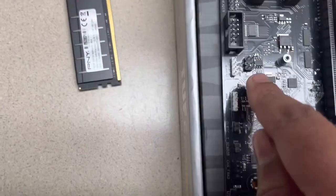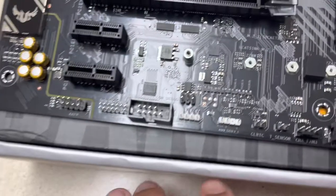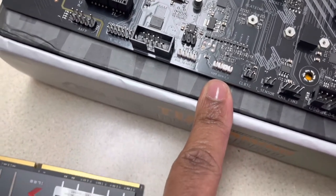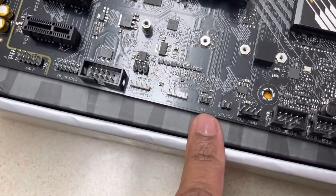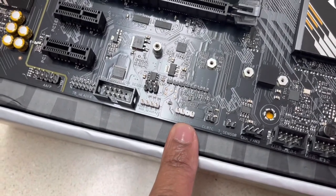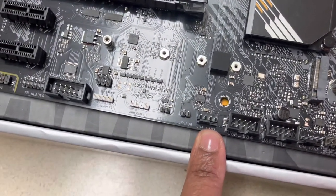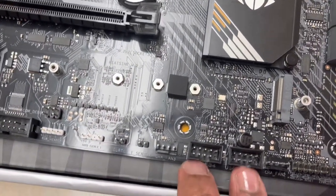This is for your addressable RGB headers — if you want to put LED strips in your case, that's what you use here. This is your addressable 3-pin header for your fans — case fans or anything else. I'm going to hook my front case fans up to this and run them up through the bottom. Over here you have your CLR RTC, your sensor, and your fan headers. This connector is power to your fans; this one is RGB to your fans. I run my case fans here and also have a splitter running additional fans. These are USB 2.0 ports.